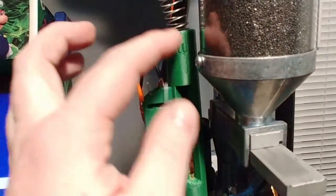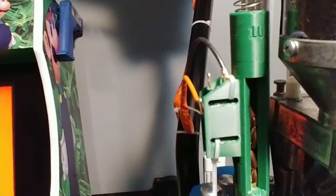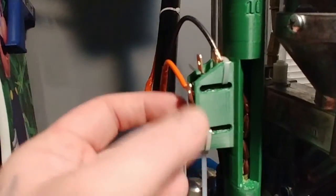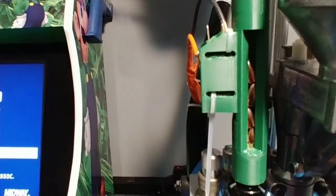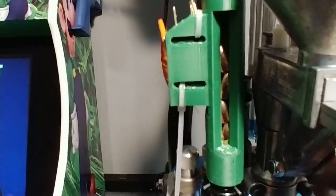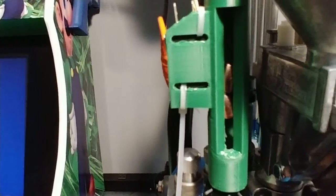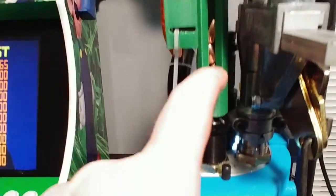In here, the bullet feeder — you'll notice this is your drop tube. These are caliber specific, as well as your shell plate. This 10mm opening is what I'm using for 9mm. You're going to hold your limit switches in here; they have large and small depending on how wide your limit switch is. They also have optical sensors if you want to run a light sensor to stop it. At .29 newton it takes a few bullets to trigger it, but that's fine — now you have 4 to 5 bullets inside your die as well as another 3 or 4 inside your drop tube, so you always have a steady supply of bullets.